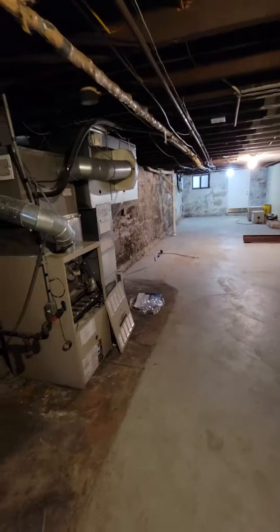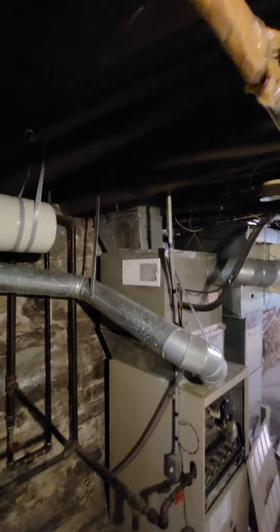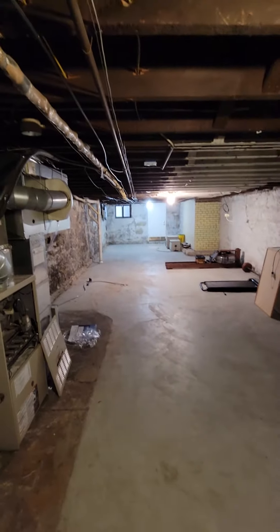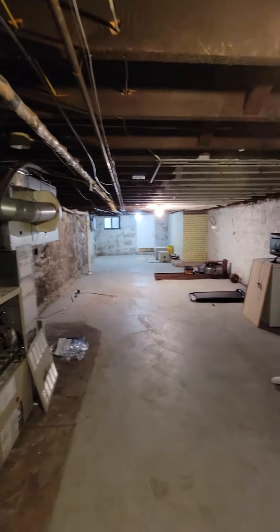So: trunk, furnace, vent for the second floor — and we're going to close off the three vents that open up to the first floor off that one so they aren't trying to feed both floors anymore. And of course that trunk over here.